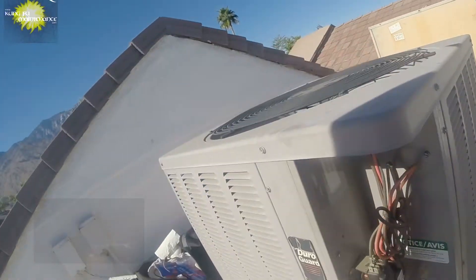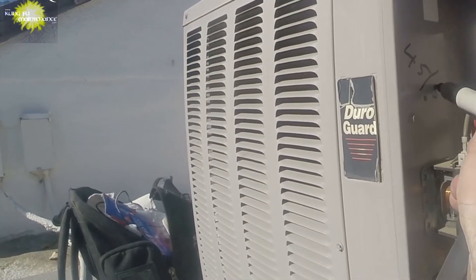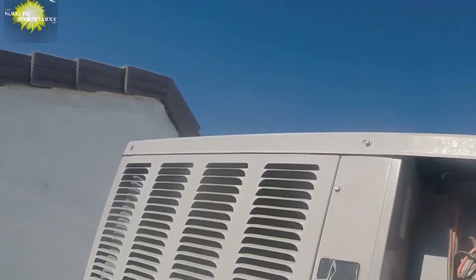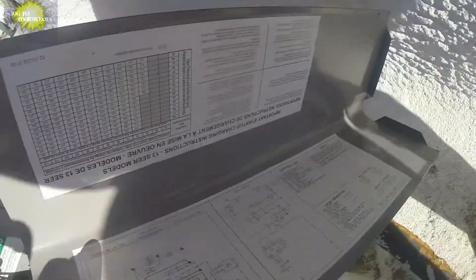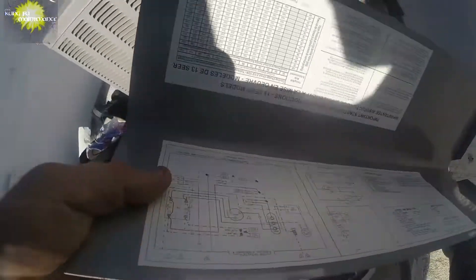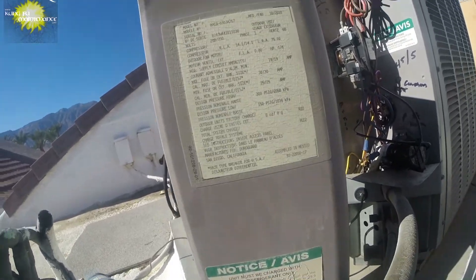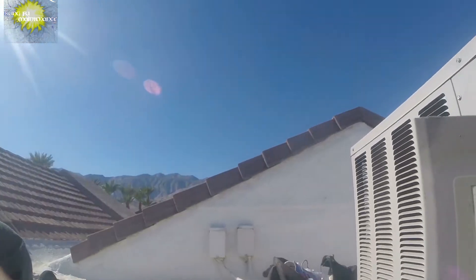Okay, one more deal — this one was a 45/5, so I'm going to write that inside to make it much easier for the next guy, not having to wonder what this one is. 45/5. I don't know why the manufacturers don't always write those. You've got all kinds of information that you almost rarely need, stuff you might never need — maybe it's worn out by the time you actually do need it. You've got a lot of information on here, but the capacitor size is one of the most common things that you need to know.